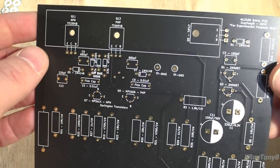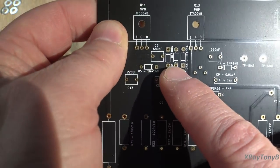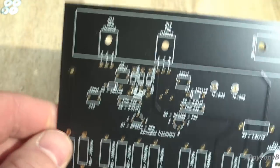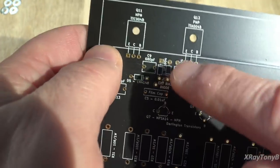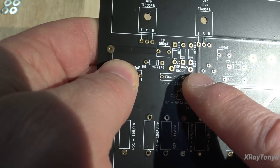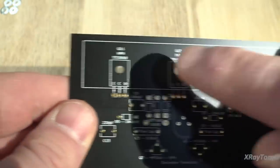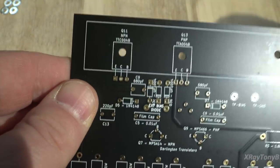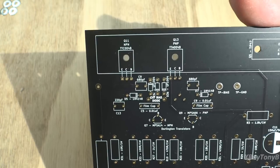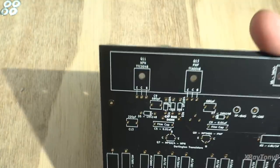Hopefully I got most of this right. It's not very different from the original board — I only made a couple of small changes with respect to the layout. All of the components are marked what they should be, and we'll go through all of those. I also added a provision for a third bias diode, so if you need an extra diode drop or want to experiment with that, the provision is there. If you don't need it, you can just put a jumper in.